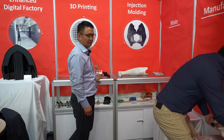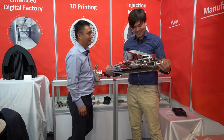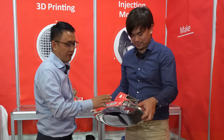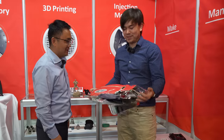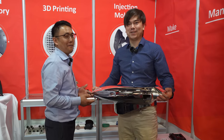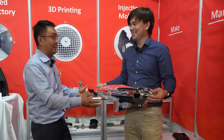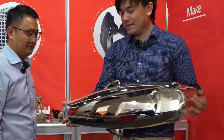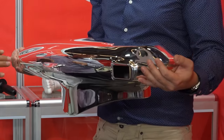And then this one right here — I thought that was going to be heavier. Why is it so light? The material is nylon. After printing, we polish the surface to make it smoother, then we do the coating on the surface. This is the final product. I thought it was going to be like a hundred pounds. Many customers come here and say, oh, this is very big metal — but in fact it's just plastic. And then how did you get the metal surface finish? It's coating — it's a chroming process.